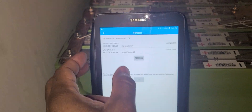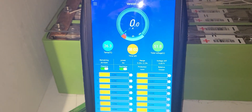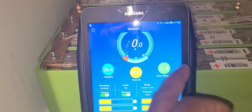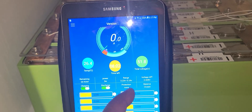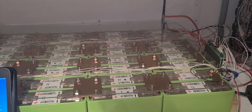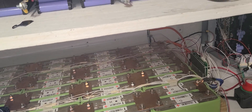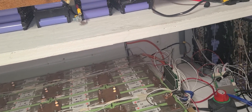Let's check this battery — it's well balanced, very well balanced. I'm not using anything on this battery; I'm using whatever I'm producing. That's why my battery is always at 51V every night — it's a big battery bank and it takes a lot to charge. I'm producing 20 to 25, maybe 28 amps maximum, which isn't enough. I need to double the amperage.